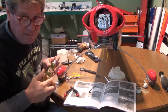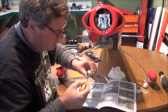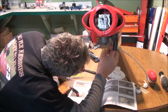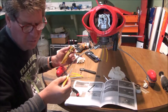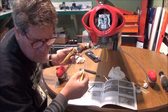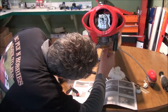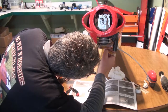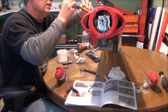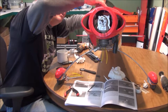I just overdo everything. I'm going to take a little bit of this silicone and put it on the screwdriver, and smear it on the side of the head of my cap screws — all the way from the bolt down over the lock washer to the flat washer. That'll give me a little extra hold so things don't loosen up. And when you're ready to take that off, you can take your finger and roll it right off, so even though it does help hold things, it can be very easily removed. That's what I like about this.